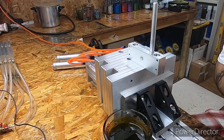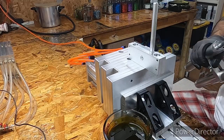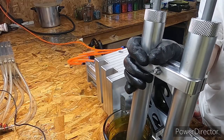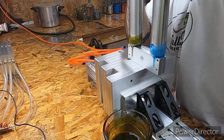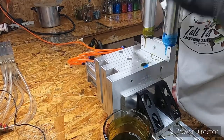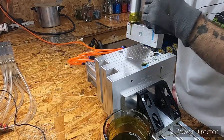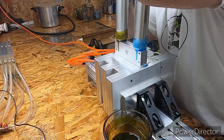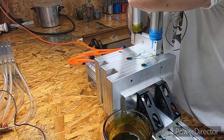And on these style baits right here, you technically don't have a head, up or down, so it doesn't matter which side you make your blue, green, whatever on. Now these were close to about 318 degrees, but by the time they get shot in cold molds and you suck it in a cold injector, it makes a difference, and it draws the temperature way down. So it ain't like they're getting shot at that exact temperature.